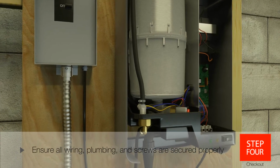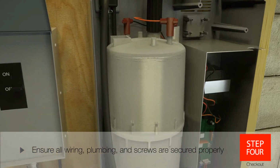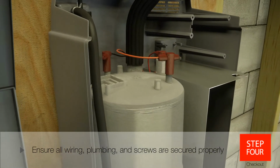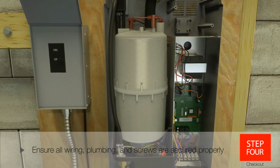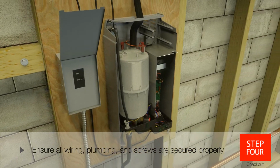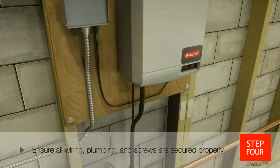Once the wiring is complete, make sure the canister is properly seated in the drain valve and that the electrode plugs are pushed all the way down on the canister pins. The canister will be the only maintained item of the electrode humidifier, which should be replaced when the humidifier tells you to. A separate replacement canister video is available for the step-by-step process. Secure the front cover with its retaining screws.